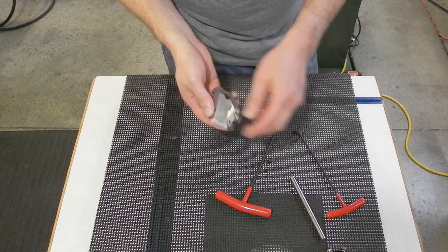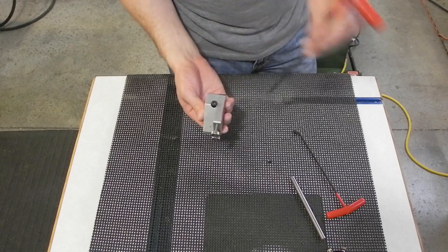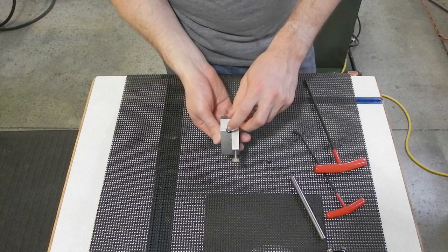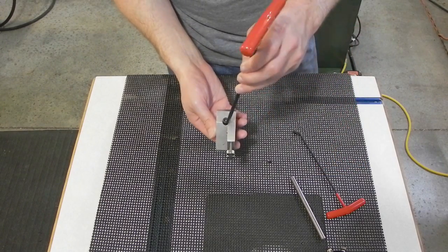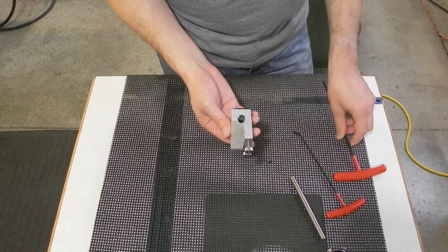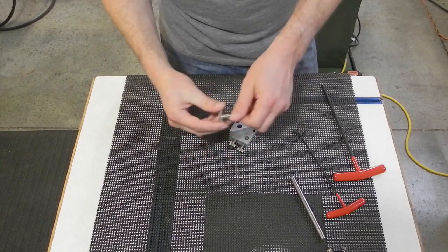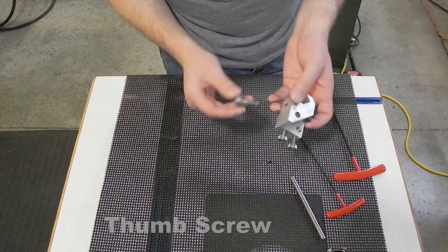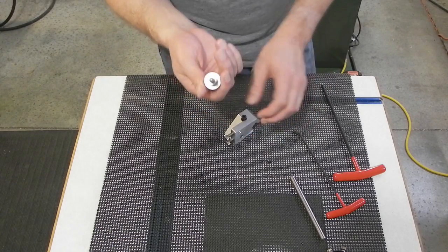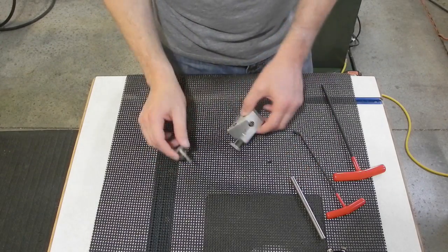And then I'm going to redesign this so that instead of having a socket head cap screw, I can adjust from the top. There's also some issues, since my lathe takes little tiny cuts, I get little tiny chips in here, and you have to dig them out sometimes just so you can adjust it. It's just annoying. So I've got a bigger knurled nut here, but I'm going to redesign this so that it pulls down from the bottom. You screw in from the bottom and it tightens up, and this should be enough force that it'll hold it in place.